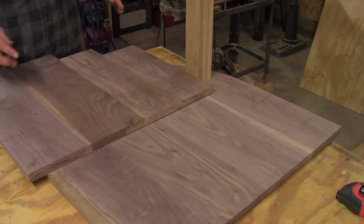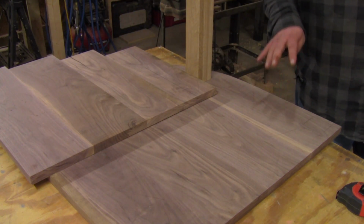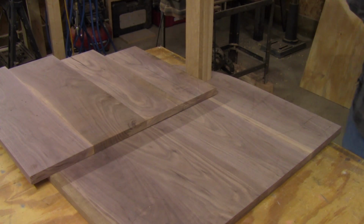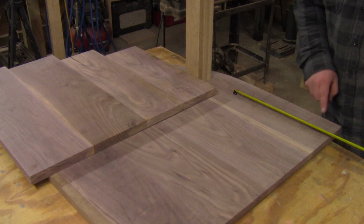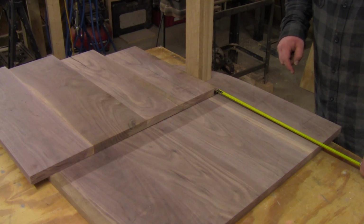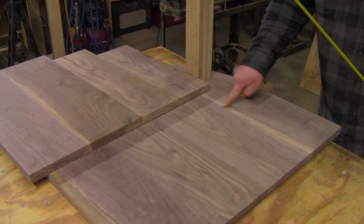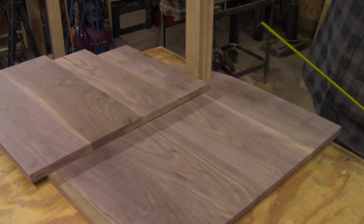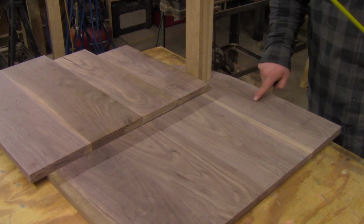So I'm looking at the size of an air fryer, and I think if I go from this leg over here, there's going to be a waste basket that's going to slide underneath, like a trash can. Usually for a small one they're 12 inches wide, but I like to go 13 inches. So if I measure from the edge where this leg is going to be here, measure over 13 inches, and make a mark all the way up from here, I can get a nice accurate measurement to where the shelf is going to end. This is going to be lower to the ground, and this is upside down, obviously. And there's going to be more space from this to the lid itself.